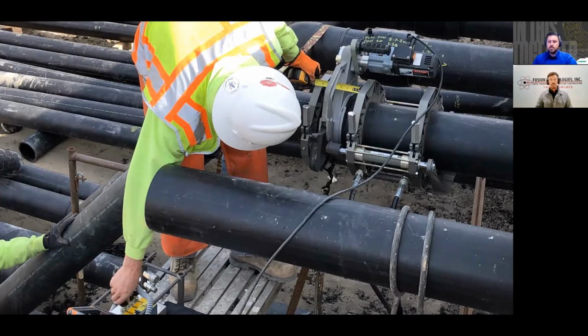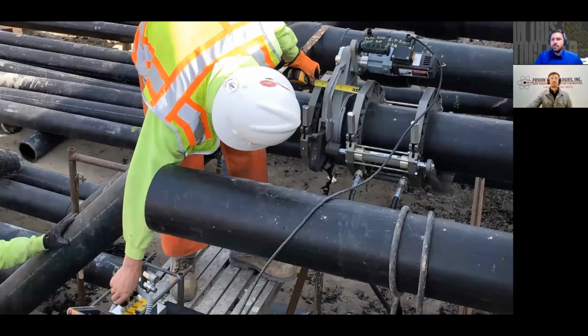That's something that we had been observing from the beginning of the project, and something that my apprentice Tristan was practicing. We had brought our Trackstar 412, so he was up above fabricating the offsets and the elbow sections, the vertical sections of pipe, and practicing that technique as well, so that he could make those offsets the exact length that we needed from center of elbow to center of elbow. I'm doing the same thing here, and you need to observe that, or do a couple practice runs so you can figure out what that distance is, because it changes with every pipe size and DR. It's not the same for 8-inch as it is for 16-inch. But with the Acrobat, we were just able to nail that 12-inch specification. So it turned out that it was a very precise machine.